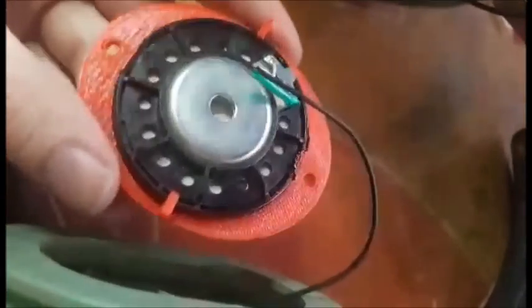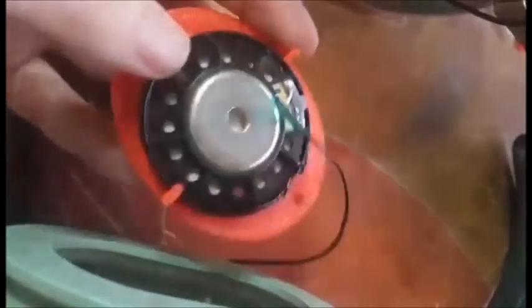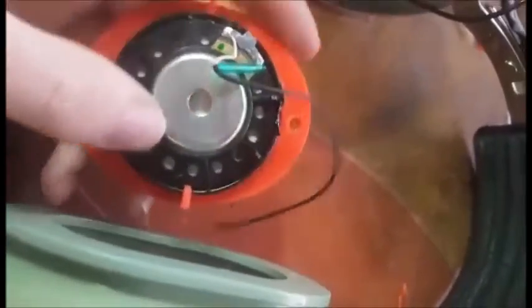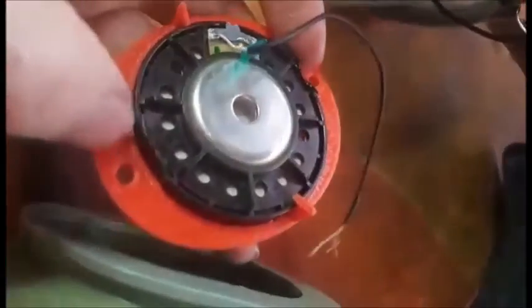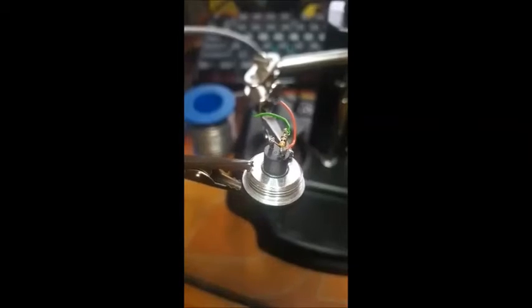This is what the speaker looks like when it's inserted with the little adapter. It's got a little recess in there, and this is the cover - holding firmly that way with the two clips pushing it down so it's nicely within the inner ring. The two mounting holes are there and I deliberately did a melted touch at the top and bottom with the soldering iron - about half a millimeter on each side - so it fits in the gap.